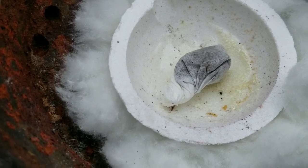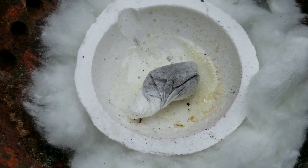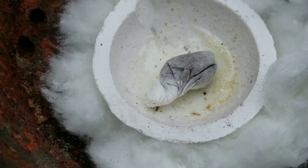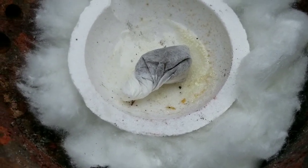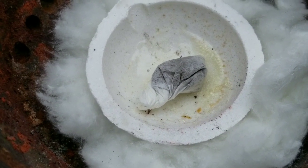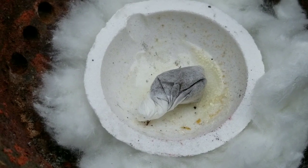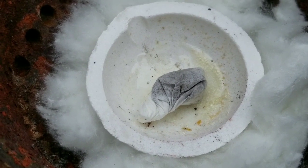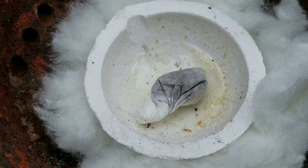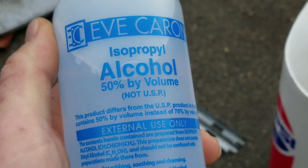I have wrapped and tightly squeezed into a coffee filter, and now I am going to soak the coffee filter in rubbing alcohol. The rubbing alcohol will basically evaporate off once the torch hits it, however it leaves the gold a little bit sticky and the gold will clump together and it helps. By the time the filter is gone, the gold stays put. So I'm going to get this wet with my rubbing alcohol and then I am going to add some borax.